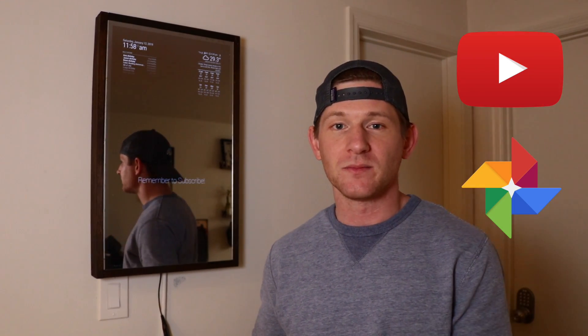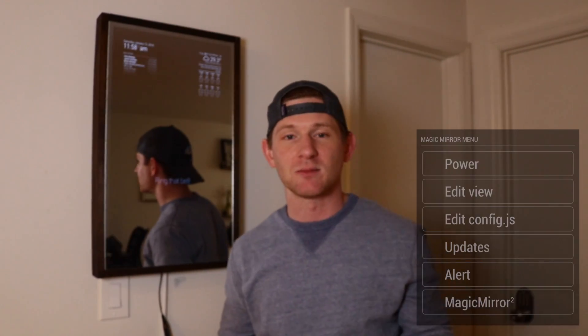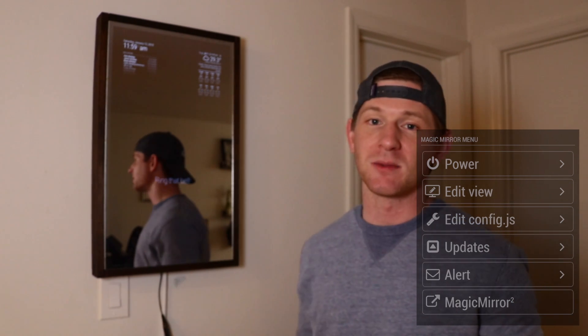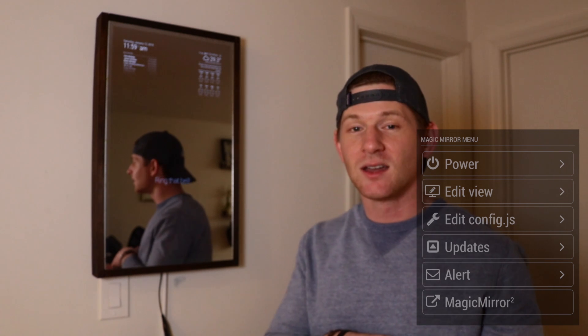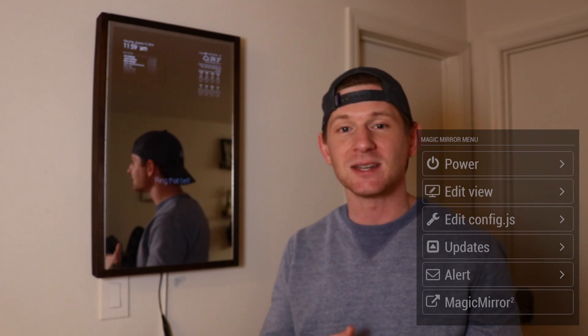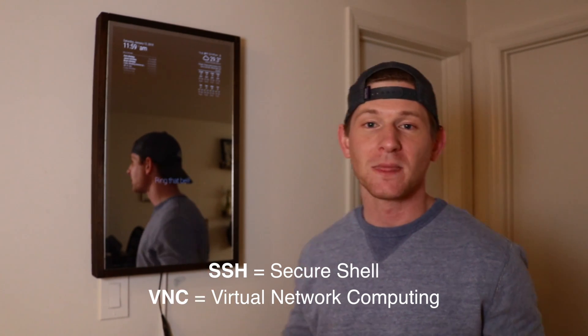If you don't know what a Magic Mirror is, I'll throw some videos up in the card that will walk you through how you can make one of your very own. The two modules I'm going to show you today are a YouTube module and a Google Photos module. The way that we're going to manipulate and work with the mirror is to use this Magic Mirror remote. I'll throw it down here on the bottom of the screen so you can walk through it with me. The remote allows me to manipulate what's up on the mirror — I can hide or reveal modules. I can actually even augment the configuration file from my phone. This just makes it a little bit easier than going on your laptop or your computer and going through SSH and VNC, which are just basically remote ways to access your Raspberry Pi Magic Mirror while it's up on the wall.